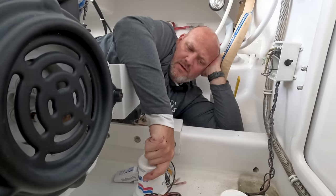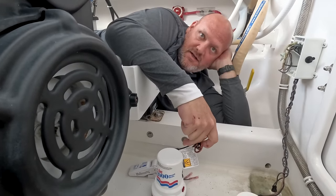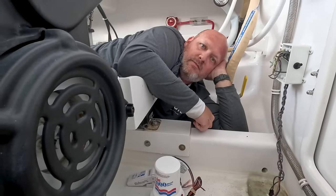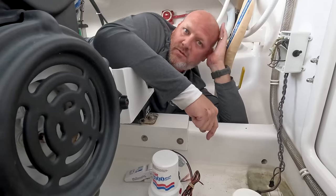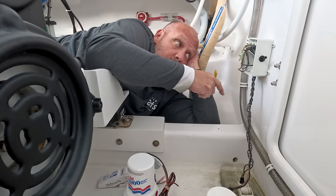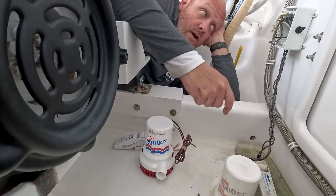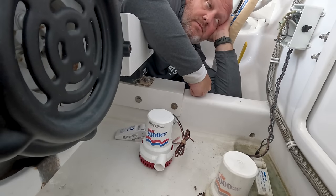Right now I'm prepping the wiring to install so we can clip these wires and go straight to connecting. Since I know these wires have 12 volts on them, while I have them clipped and disconnected, I'm going to put tape over the ends to make sure they don't accidentally contact each other — because shorting 12 volts straight to ground could cause damage. I'll clip the wires one at a time, insulate them as I clip them, and have butt splices already installed so all I have to do is pull the old wires out, put the new wires in, and crimp down the new butt splices.